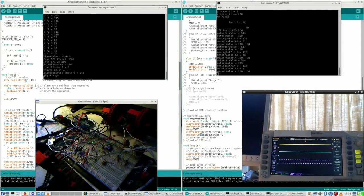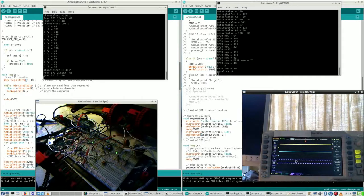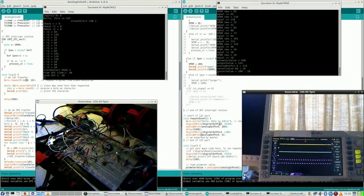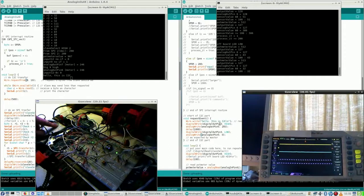And then I have put here a wire in the same lane as where this wire is coming from for the pulse width modulation. And I've put a probe, and guess what I see? Pulse width modulation. And this is analog out pin 5, which means it has a signal. So now I am going to put the wire back into out pin 3 to see if it has modulation. Because right now, although I have a full signal on this probe, this LED does nothing.